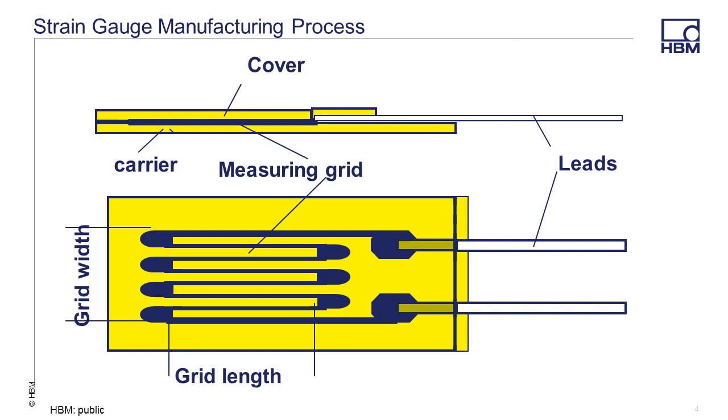In the development process, the non-hardened parts are washed away. The individual gauges are then separated from the sheets of gauges and tested to verify that they meet the specifications, and a correction factor is defined.